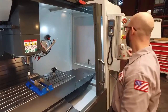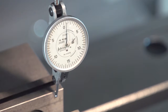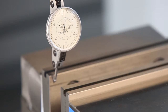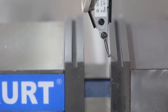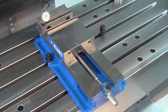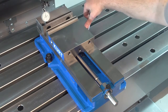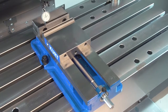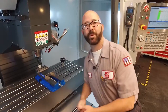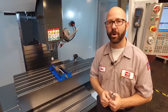Now we'll jog back across the vise. It looks like my vise is still off by a couple of thou, so I'll tap it in again. We'll go back where I started, re-zero my indicator, and then check it. My indicator now reads zero across the entire face of that back jaw. At this point, I'm going to go ahead and snug down this other bolt and give it one more check before tightening them completely. We set this vise with only two sweeps — but even if it takes you five times going back and forth, it's a method that's going to work 100% of the time.